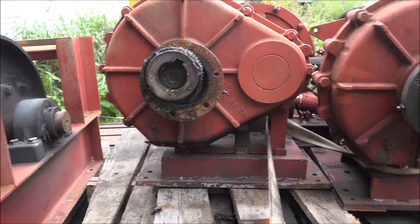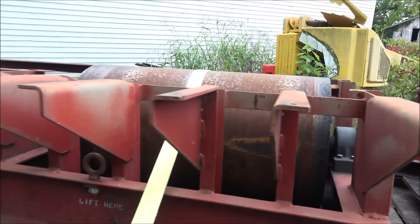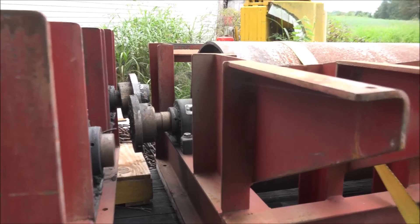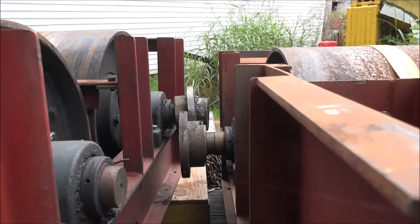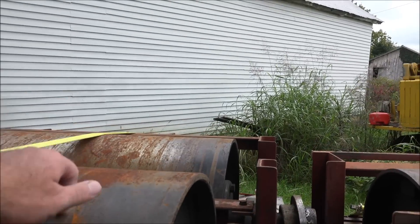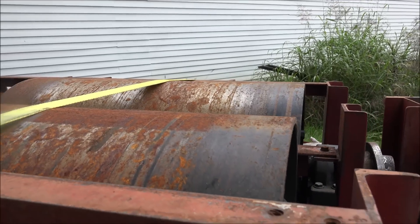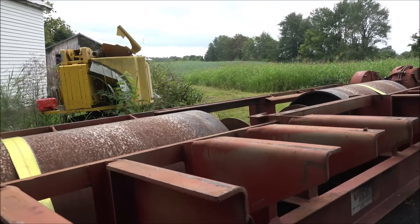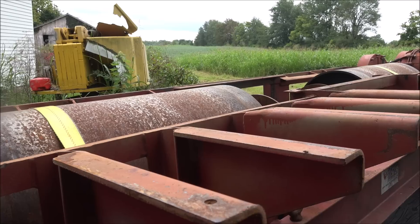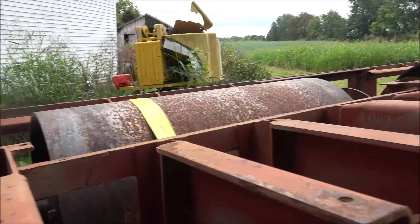Got couplers on there like what I used on the Heister — that's the rear roll coupler, and a coupler for the front set of rollers. Usually on a tandem axle semi, it's set up so the front set of tandems sits in between the rolls, and the back one sits on top somewhere. Then depending on the wheelbase, it sits either to the front side, on top, or the back side depending on what the spread of the tandems is. That's why it's not four sets of rollers.